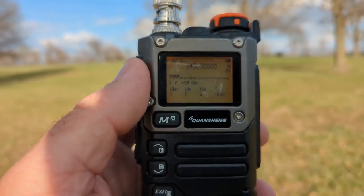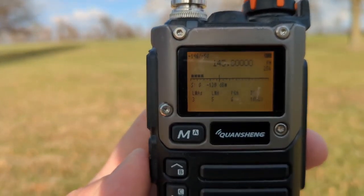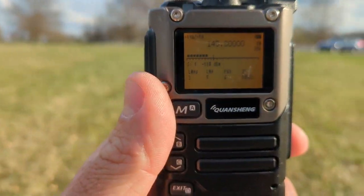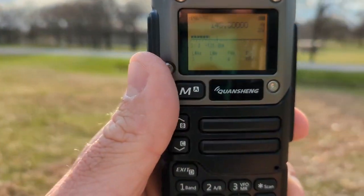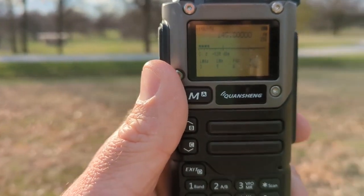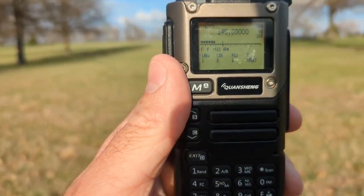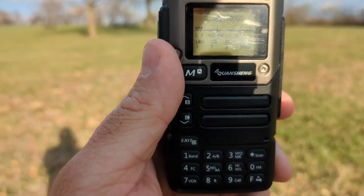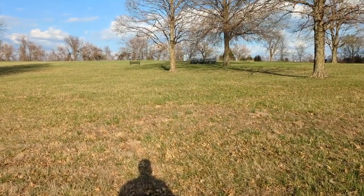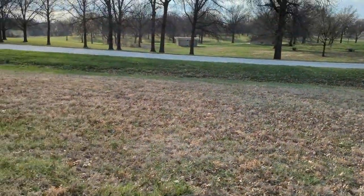Let's do that. Starting to turn — my signal is nice and strong, then it drops pointing in this direction, comes back up, and at 180 degrees opposite, it drops again. So my radio signal is coming from either that direction — which is the correct direction, that's where I put it — or 180 degrees opposite. No way to know. Except I take one bearing, plot it on a map, walk off 90 degrees to the side, take another bearing, and plot where those two lines intersect. That tells me which direction it's coming from.